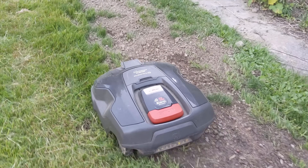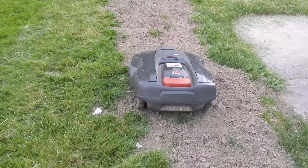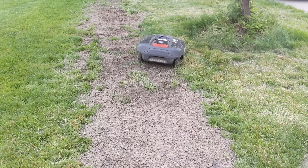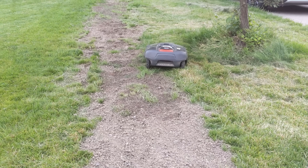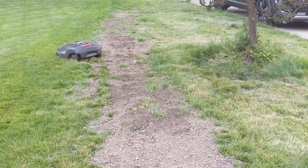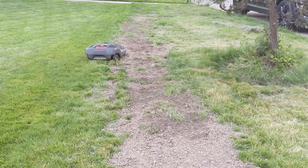After I finally got my boundary wire repaired I ran into my second issue of the season — one of my drive wheels had seized. I spent some time cleaning around the wheel and taking everything apart as best I could without voiding the warranty, but it still would not budge. So I ended up having to bring it to the dealer, where they took everything apart and discovered that the wheel bearing had somehow corroded over. This was something the dealer had never seen before, but they were able to easily order a replacement part and fix it all under warranty. The other side appears to be fine, so I think it may have something to do with where the mower charger is. I plan on looking into either making or buying some kind of house for it to better protect it from the elements. I also did some research on the issue and didn't really turn up anything, so it's possible I was just unlucky and had a faulty part that originally rusted on its own.